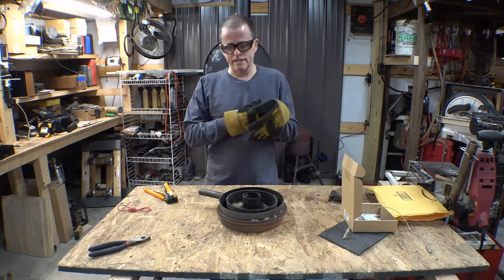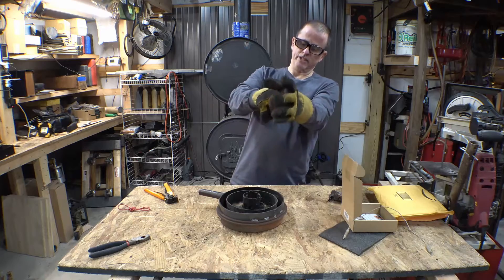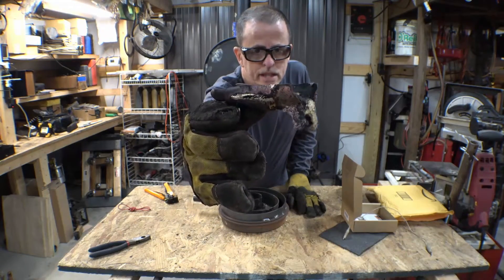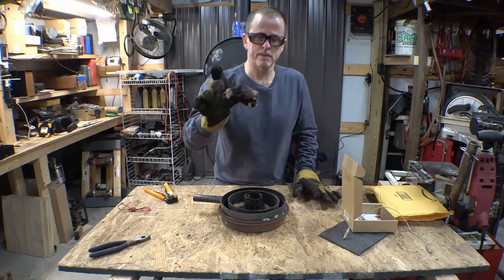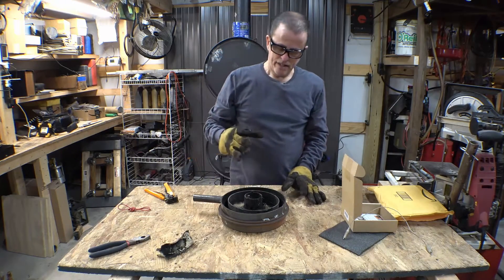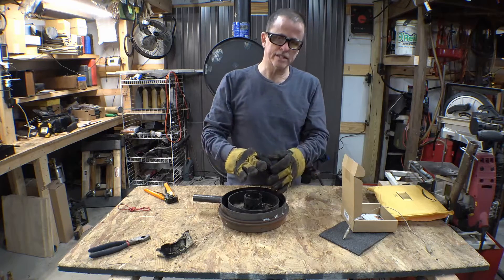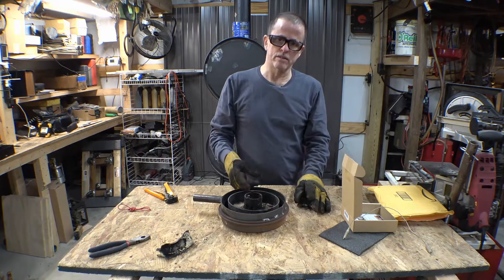There's been some comments about what I could do to get rid of the fan, and the reasons that I need a fan. I've done a lot of experimentation with this thing. One of the first things I did was make this little drip tray — made out of a piece of copper tubing that sits right about here. The drip tube was here, drips down into it, and that helped quite a bit, especially on startup. With clean oil, it just drips down in here, this thing gets hot and immediately starts burning. This thing is capable of getting this tube right here, at least half of it, glowing. It does get pretty hot down in here. But one of the reasons it doesn't get any hotter is I made this to burn low quantities of oil.